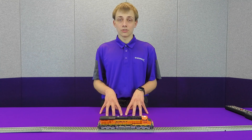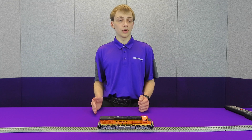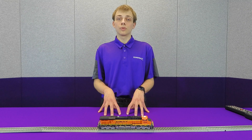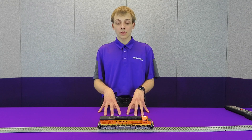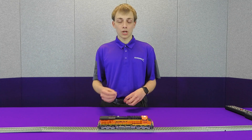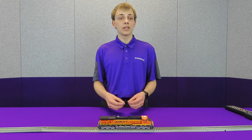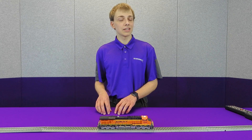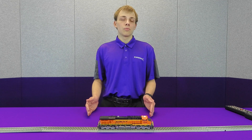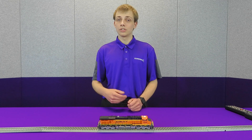What this allows it to do is figure out exactly how much load the motor is under. This is also why it's important to calibrate DDE first before using it, because every single mechanism is going to be different. In order to use DDE effectively, you want to make sure it is well matched to your mechanism so it knows what the baseline is and therefore what to look for when it's under a light load or a heavy load, and it will adjust accordingly.